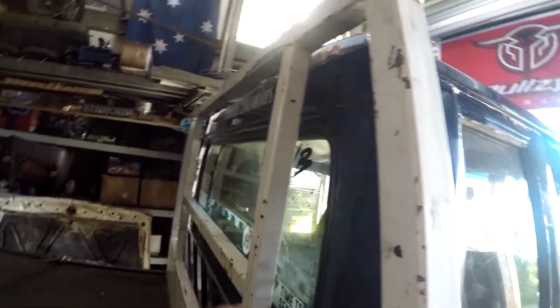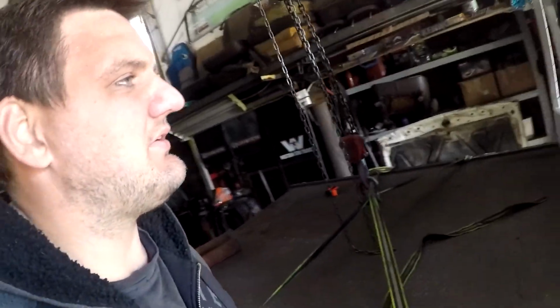The rear window is also square because it went from there to that beam up there, so I can measure anywhere around the glass, and it should be almost perfect, but it's probably not perfect because this is garage built. But that doesn't mean it's not quality. I built this here at home to what I wanted. It's engineered and it's strong, so it doesn't matter if things are a little bit off. I think I had the whole cab down to about 2 mil throughout, and that was a lot better than what the car was made to on the assembly line, so I was happy with that. But that's the rear.